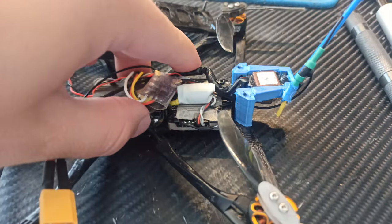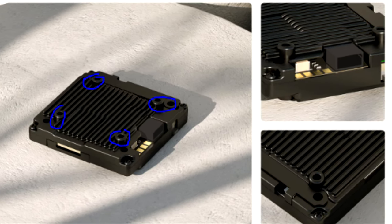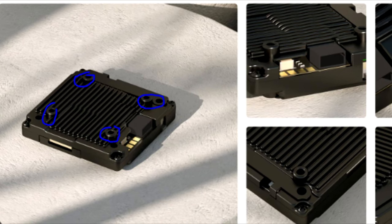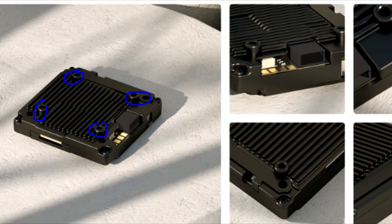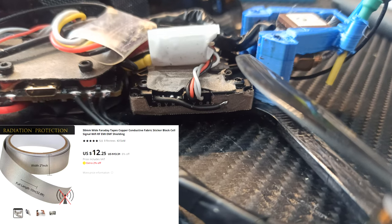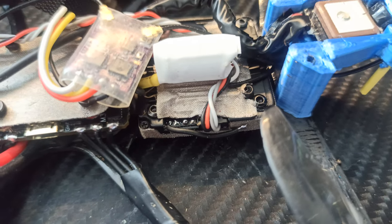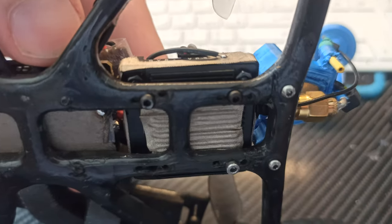Unfortunately the box has a contact pad underneath the M2 screws but the screws themselves are not conductive on the outside. So choose some screws that are not painted and it will help a lot — this connects the top and bottom parts of the cover and it will be completely grounded. Then you can grab some EMF shielding tape, tape the VTX around, and connect the shielding to the ground pin. This will prevent noise from coming outside of the VTX box.